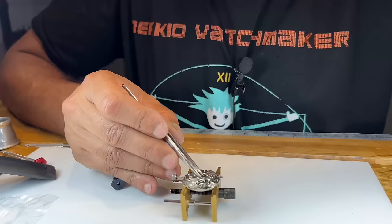And the click screw is also acting as a screw for the bridge. And that is a different screw to the other two. A very impressive looking click. Got another little spring there. I'm going to take that off so I can oil it up. So, see all these needs to be oiled. We can probably just slide this mainspring out.